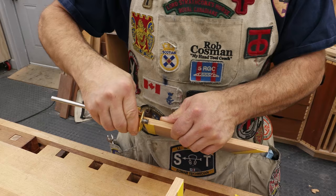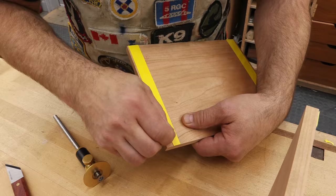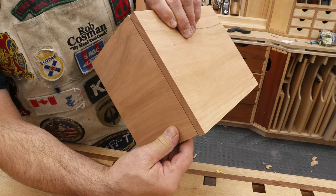We'll leave a link below to our video on cutting dovetails if you need help. I just wanted to mention that cutting through the tape always works better if you do multiple passes. And then just lift this section up, and that'll provide you with a good ledge. So when it comes time to lay the tail board over the pin board, that'll reference against there and it'll line those two pieces up perfectly.